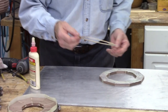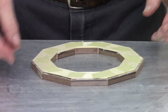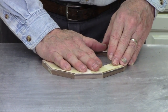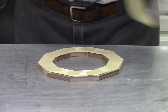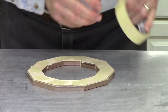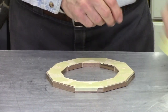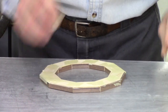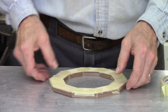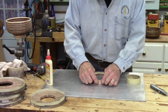I've got this veneer ring and I'm going to line up the joints — on these small veneer joints it doesn't really matter, and the next ring will be offset for reinforcement anyway. I'm perfectly centered on this ring. I'm going to add a little bit of tape on four sides, just for insurance to keep it in place. I've got to do this process on every single one of these rings. Why do you charge so much for these things? Well, there's a lot of labor. It would be a lot less labor without the veneers — because I've got twice as many segments when you add the veneer in, it's really twice the labor.